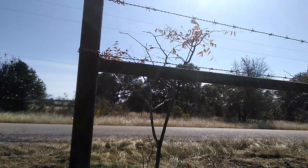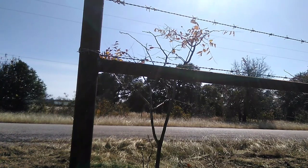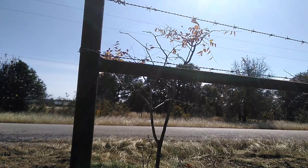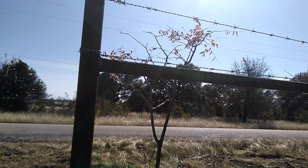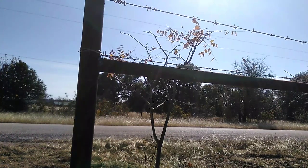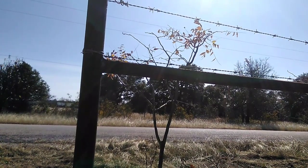I'm gonna try to show y'all the right way to make barbed wire work. Down on my second post — my H-post, if you will. The reason is to get it out of my way. I'm stretching it out at 1,100 feet here.